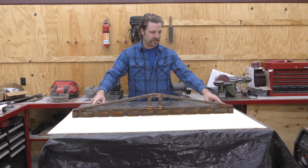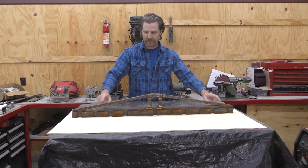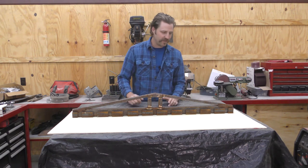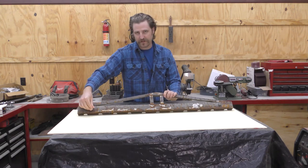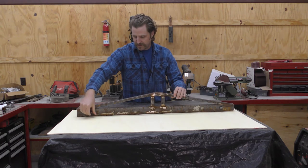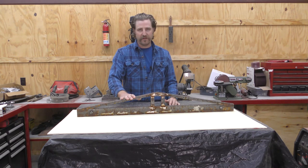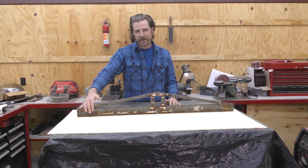These bars make sure that the force when it's pulling the center gets distributed down to the opposite end. You probably don't have to have it all the way down to the end — I just happened to have the extra metal. Even if you put it somewhere in this area, you'll still get a full even stretch along your whole fence. The last thing I did, which I think is very helpful, is I went ahead and put these little stops in right here. That way, when I slide the fence in, I can screw these bolts in, keeping the fence in place constantly. It can hang on there, which is very nice. If you've ever used the old ones where you finally get the stretcher put onto the fence and while trying to get your hi-jack or strap in place it slips off — these bolts prevent that.